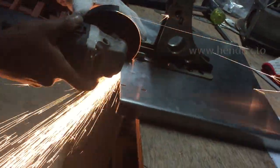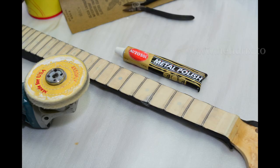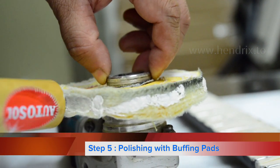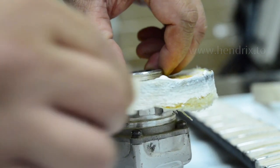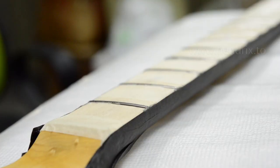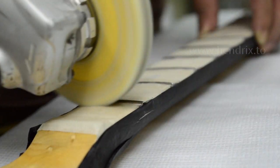It's much more powerful. But you may already guess, or wonder, whether polishing compound on an angle grinder can be fine everywhere, like using an angle grinder on metal. So there are some precautions to take. After wiping the polishing compound onto the fiber wheel of the angle grinder, first I put the angle grinder inside a trash can to turn it on. When it first rotates very fast, the polishing compound will fly inside the trash can rather than everywhere. After it's turning for a few seconds, there will be no more polishing compound flying off the wheel. But when you use it on the neck, there is still some debris flying off the polishing wheel.